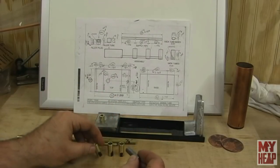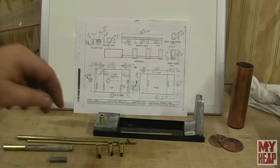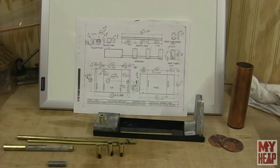I'm leaving my mistakes in here, and I think it's important because there are other new aspiring wannabe machinists, like me. So I think it's important to show my mistakes and learn from them. Another thing that I noticed was that even though I calculated the speed for the brass, it was a little too fast, and the 3/8 drill bit I was using was pretty dull. Once I pulled it out of the Jacobs chuck and took a good look at it, I was like, yeah, it didn't help me any.